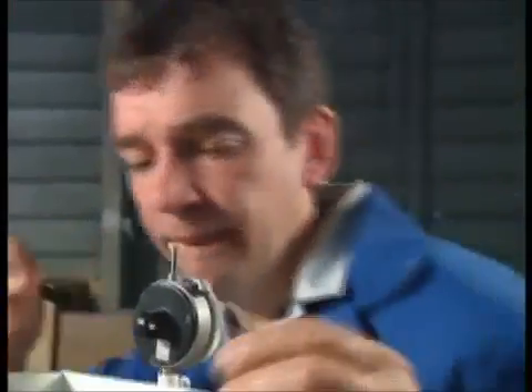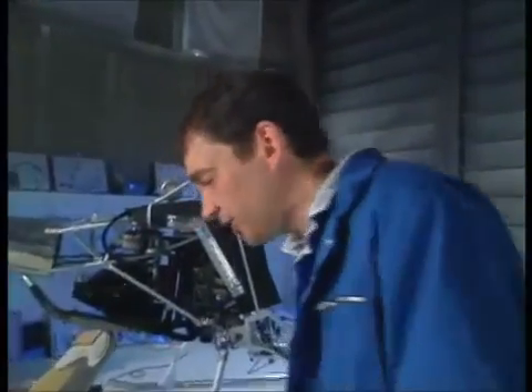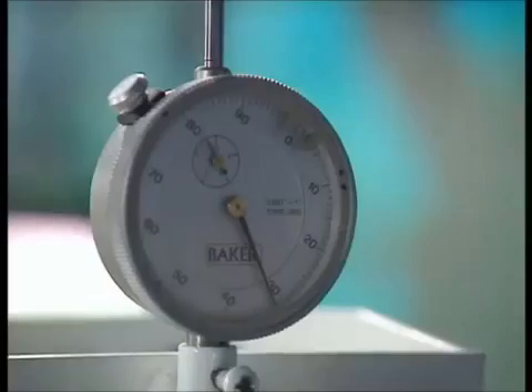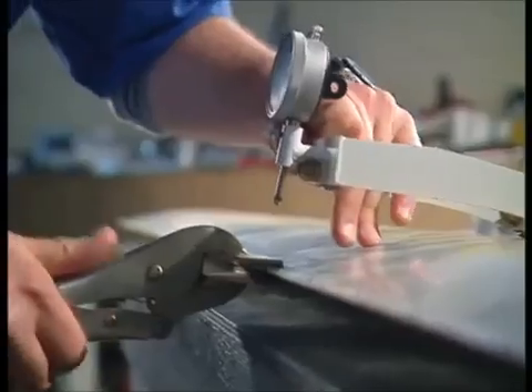The reason it's important to have a consistent chord line is presumably because if you didn't, you could end up with terrible vibration and put the blade under enormous stress. I want the average of: thirty-one, twenty-one, twenty-two, thirty-three, thirty-six, thirty-eight, thirty-three, thirty-four, thirty, thirty-one, twenty-nine, thirty-two, thirty-one, twenty-seven, twenty-eight, thirty-five, thirty-six, twenty-seven, twenty-nine, thirty-two, twenty-six. Thirty-two thou is what we're going for, precisely.